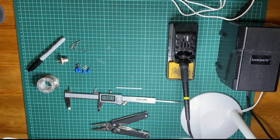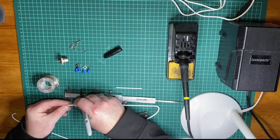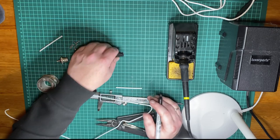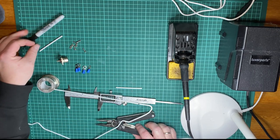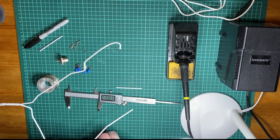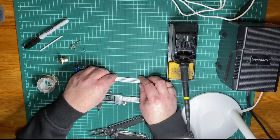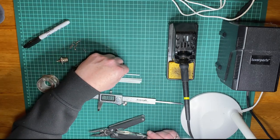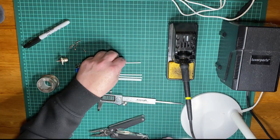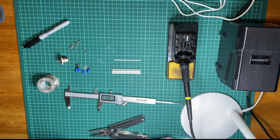Let's just use our first one here to do the rest of the measurements. And I know that some of you guys are going to comment that this is not accurate enough, but trust me, it is for the purpose we're doing today. So there we go. We've got that element here, which is 6.5 centimeters. And we got the radials here. So you can see this is a compact and small antenna.